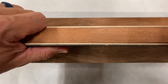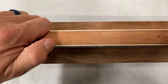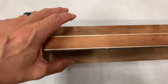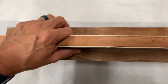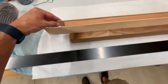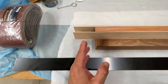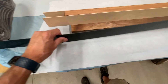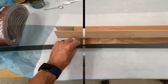To give you an idea of what I'm doing, I'm going to laminate all this together after I cut the riser block. Basically I'll have a black stripe, a light stripe, thicker pieces, coco bolo, a white stripe, and then another black stripe - and once that's all laminated into the riser we'll be ready to do the actual work per the instructions. Just trying to add a little flare. Haven't done this before, so we're going to give it a shot. First thing is to trim these pieces to size.